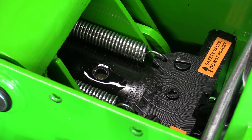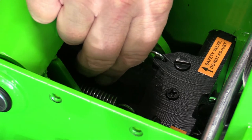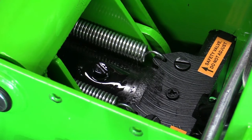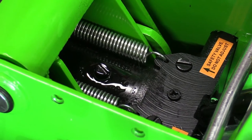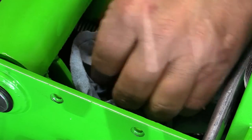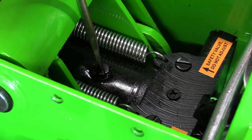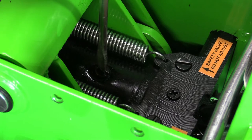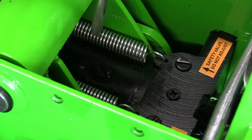It took more oil than I expected — they just didn't ship it with enough hydraulic oil. I replaced the screw but didn't tighten it all the way down yet. If you take the handle and turn it counterclockwise and give it a couple of pumps, you'll see the oil starts to seep out around the screw — now you know the air is out of the system. Dry it off and tighten the screw snug. Don't over-tighten it. If it still leaks, get a small rubber seal from an auto supply store.